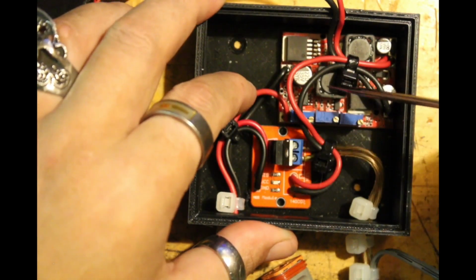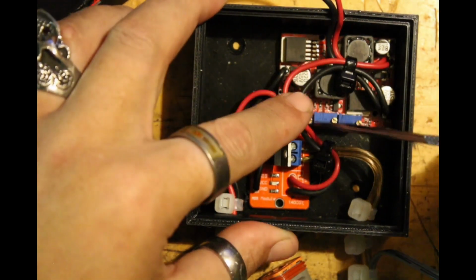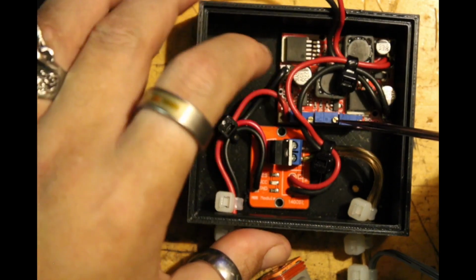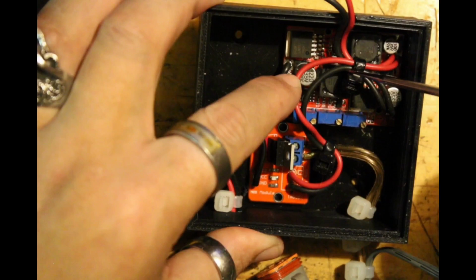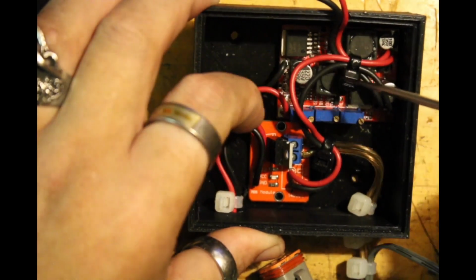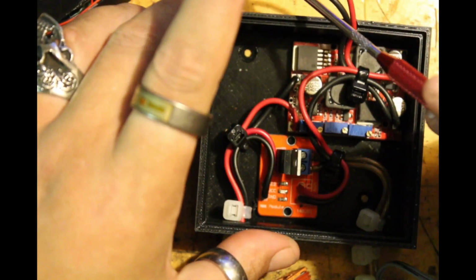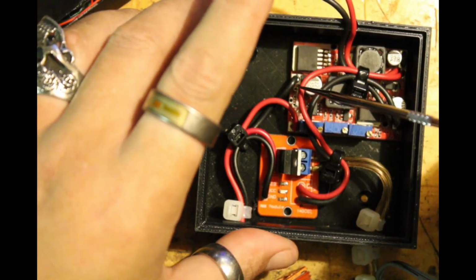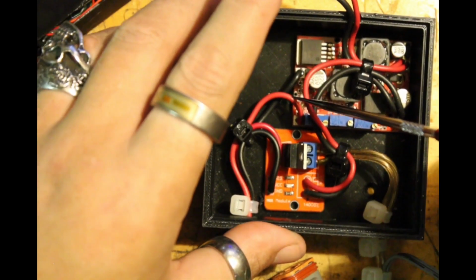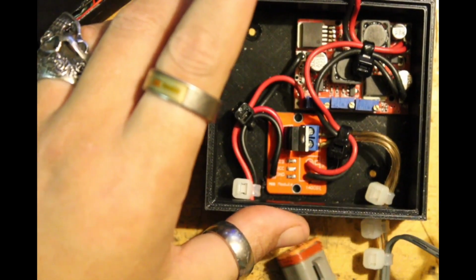But also in here, like I said, in parallel is the buck converter, which is an adjustable buck converter. I do believe this may actually be a buck-boost converter, but it is one I had on hand. It shares the power lead to the batteries and then takes this higher voltage and steps that down to the voltage needed by the Pi Pico, which I have bringing it down to 4.5 volts,